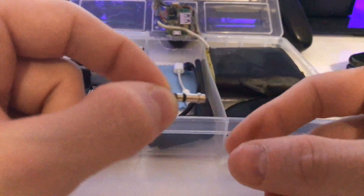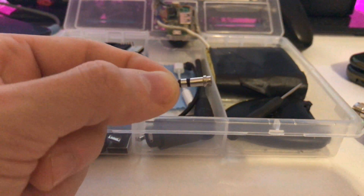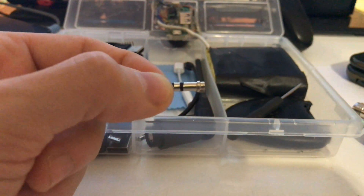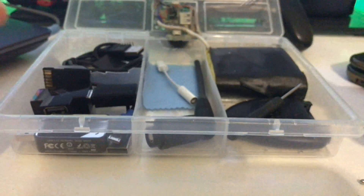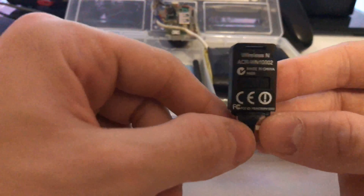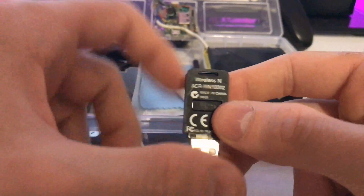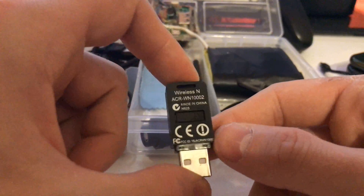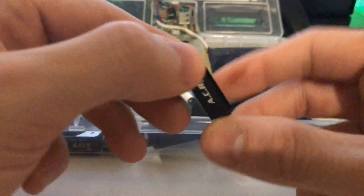You need something like this — a headphone jack that is cut off — to just activate the headphone jack in your 3DS. You will also need an extension cord for the audio. Furthermore, this is not required but it's very useful: a wireless USB module, a 300N. You won't need that much bandwidth but it's useful to have, since your 3DS has only 54 Mbps, so having a strong connection is important.